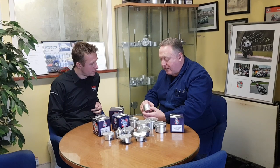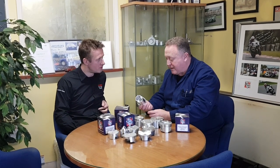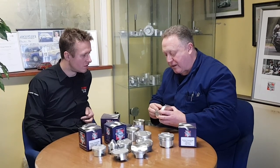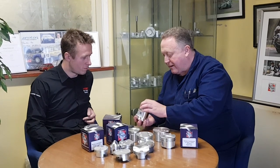We hold ±3 microns all day long on that machine. We guarantee ±5, but it normally holds ±3, which is very tight. If you didn't have this elliptical shape it would definitely seize up. And if you've got it running a bit too tight in the bore it gets even hotter. So we always recommend ±3 microns clearance. Some other piston types need more ovality, some need less. A piston like this with less metal around the boss area usually needs a lot more ovality — the heat has to go along there and push those faces out, whereas more metal around here absorbs the heat.